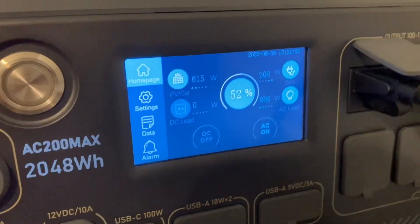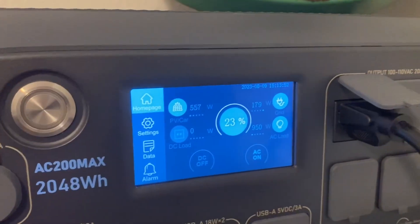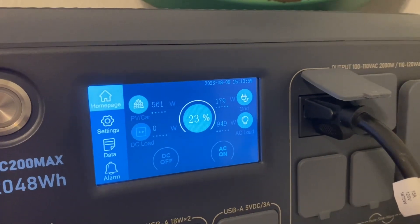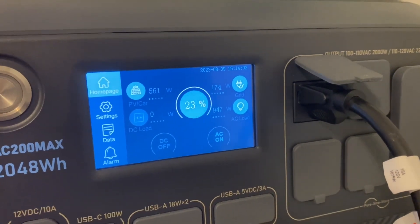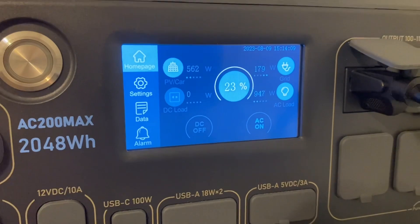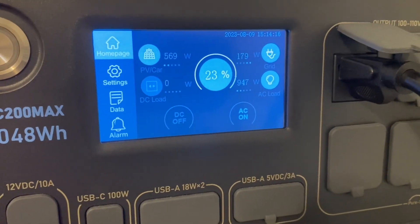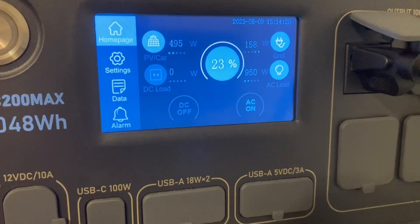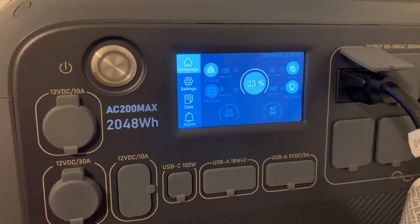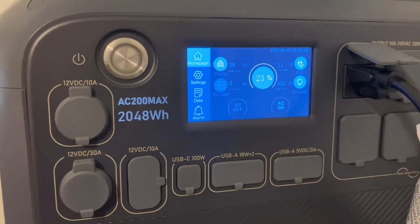We've been running about six hours now - let's see where we're at on the AC200 Max. We have 23% left on the battery. We have 550 watts coming in through the 800-watt solar array and 179 watts coming in through the 300-watt array - the 300-watt setup is starting to get into shade now, so that's going to start fading. All day it's been partly cloudy; we even had a rainstorm in the middle of it. The air conditioner is pulling 950 watts. I'm going to stop here - six hours without expansion batteries. The other day without solar we did two and a half hours; with solar we've done six hours and we still had more to go, but I'm turning it off now to let the solar recharge it.